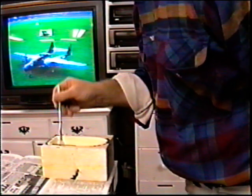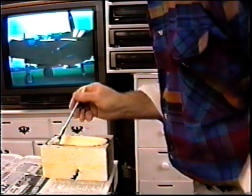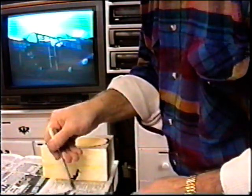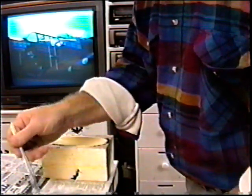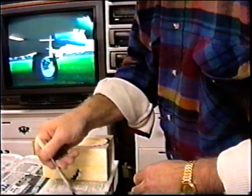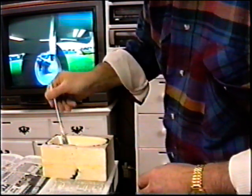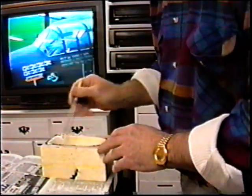Now, as I always do, get the corners, put a little bit of Cabosil in with the epoxy, make up a little paste batch, get down in the corners. Again, we really have nothing to lose here, and we're probably going to have to make the mold plug over anyway. Maybe we'll even make a different cowling shape, but this at least gives us one more choice.